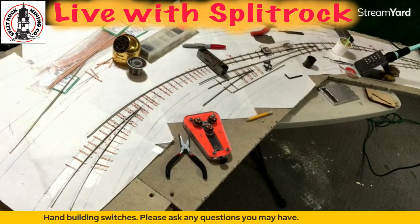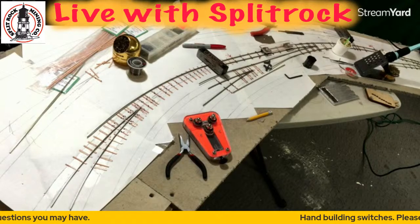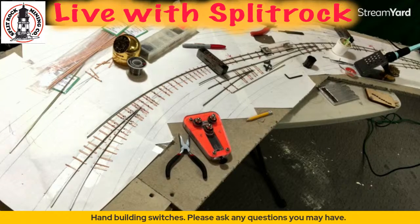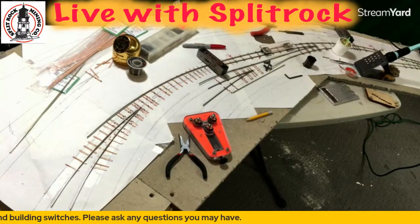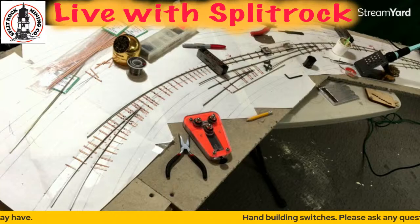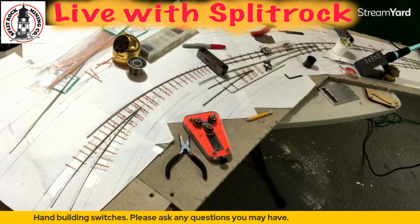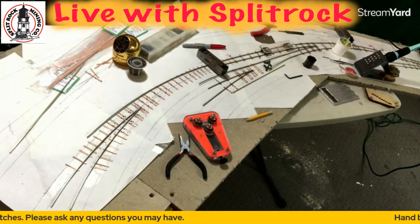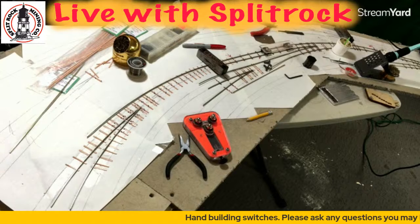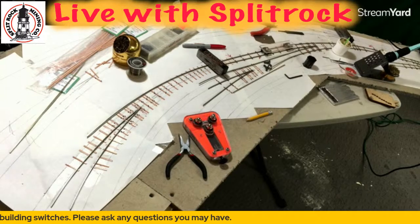What I'm doing, Daryl, is building this curved yard ladder for a friend. And I just soldered in the piece where you can see the clear car there from Micromark. And I've got all the frogs in. So now I'm just adding the stock rails. And then next week I can put in the points and the guardrails. I'm going to make these hinged points because that'll last longer, and you'll have a lot more of the points in gauge for the steam engines.